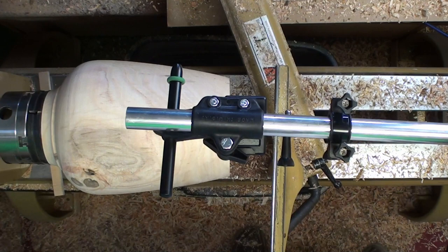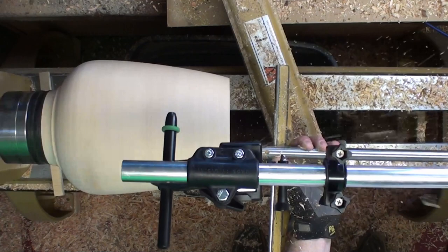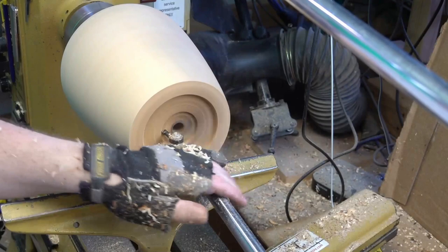At this point I'm turning on the lathe and seeing how well the cup cutter cuts. In this shot you can see chips flying — these are the first initial cuts, cleaning off the top surface of the hollow form. You'll note I'm not using the laser guide here; this is rough turning, so I'm just cutting a three-quarter inch wall thickness by eye.